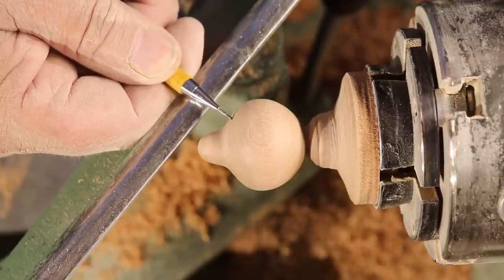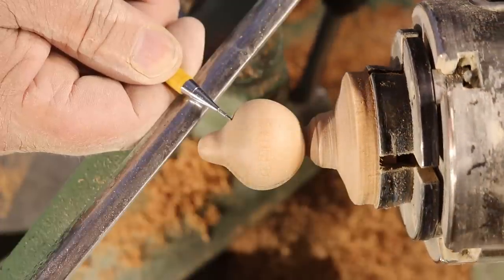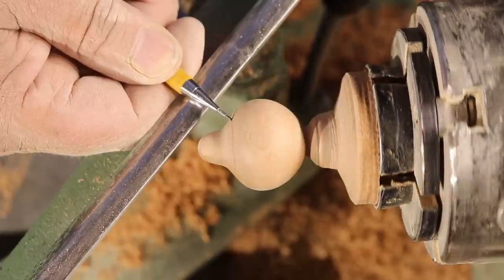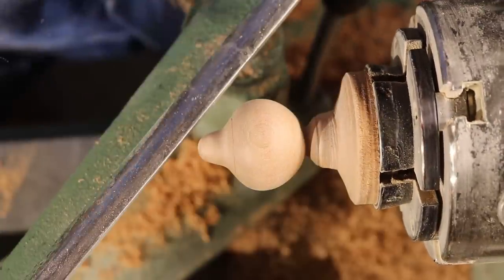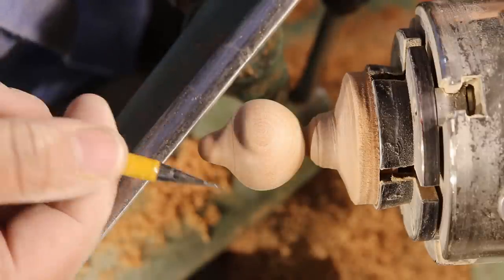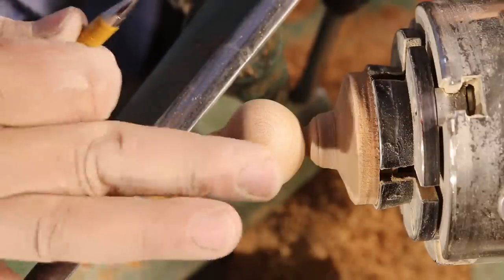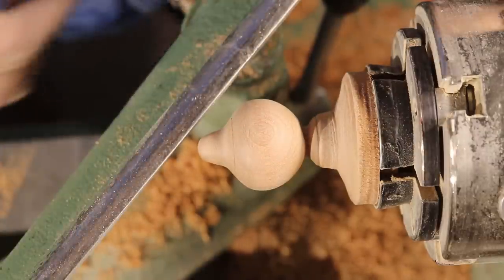And then without moving, we're going to draw just a very light line right around that arc. That looks pretty close to even between here and here. So I'm going to drill two little holes for eyes here, and I'm going to drill a hole for the nose while it's on the lathe, and I've got some nice backing there.